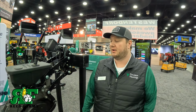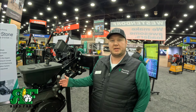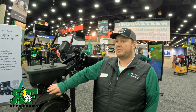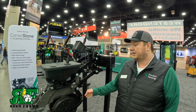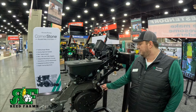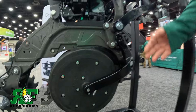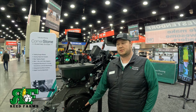Take her away. Yeah, hey, guys, Sean with Precision Planting, Practice Support Team here. Just taking a look at Cornerstone, all factory integrated precision planting technology from the bar back, right? So getting things like our rear tipping hopper, being able to shut off our seed pool, remove that meter, get in there, be able to service that meter, getting a lot of adjustability. So alignment of our closing system, some depth calibration features that we integrated into this. Obviously, if you look, trailing gauge wheel arm styles. We did a lot of studying on gauge wheel arms and the best effects that we can have, and really closed in on a trailing style gauge wheel arm for this system.